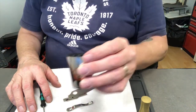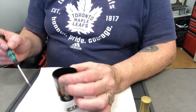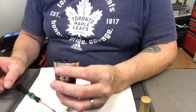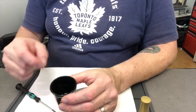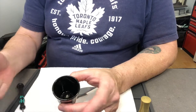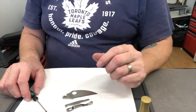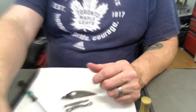The clip is also going to be acid washed. I've got the female part of the pivot inside a little Walking Dead shot glass with Norman Reedus on it — no idea where that came from. I've got a bit of solution in there and the stop pin and pivot bushing are soaking in it because there's some gunk deep inside the threads and I can't get the screw to thread all the way down. We're going to try to get that out. We'll see if our ferric/hydrochloric acid toilet bowl cleaner is going to etch this stuff.